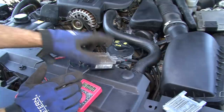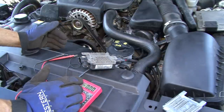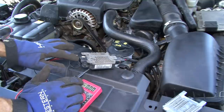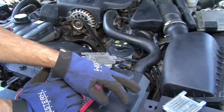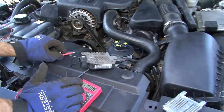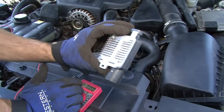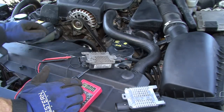A lot of times when you have a bad fan — which we just had — you replace the module and the fan together. So we're doing the troubleshooting now: when you have greater than 10 volts, you automatically know to change out the module. When I first plugged it in it was 12 volts, so we've got the new module right here and we're going to install it.